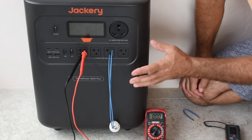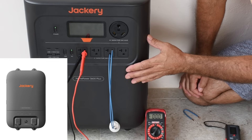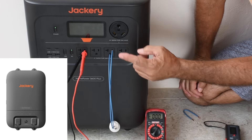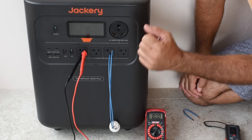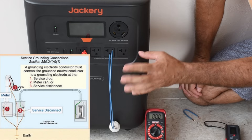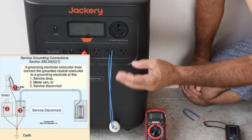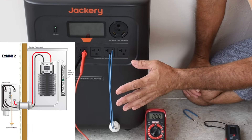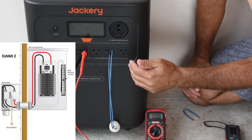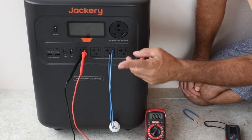What's going to happen when you connect this to your house — if you use Jackery's automatic smart transfer switch, which lets you transfer up to 12 branch circuits — the neutral in your home is also connected to a ground rod, so the neutral and ground are bonded together. Or if you have a main panel, you're going to see that the neutral and ground are connected together there. Sub panels are different — they're going to have a separate ground bar in the panel instead of just a neutral bar where all your grounds and neutrals are connected.